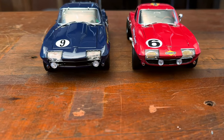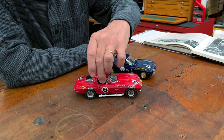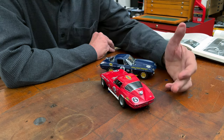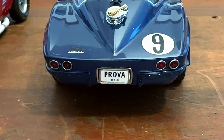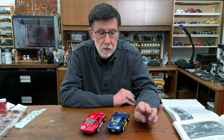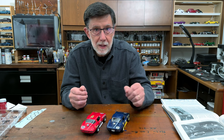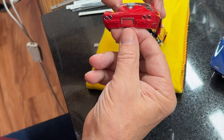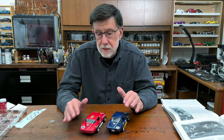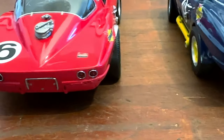The other thing was the position of the fog lights — they had to be positioned more inboard. That was pretty straightforward. On the back, the license plate had to be deleted. On the die cast it has a Prova plate, and when I took that off, there were two alignment pins for the chrome bezel right into the ZAMAC body, leaving me with two big holes. I made a flat plate to cover it — nice and simple — and added some details for the fasteners for where a license plate would actually go on the car.